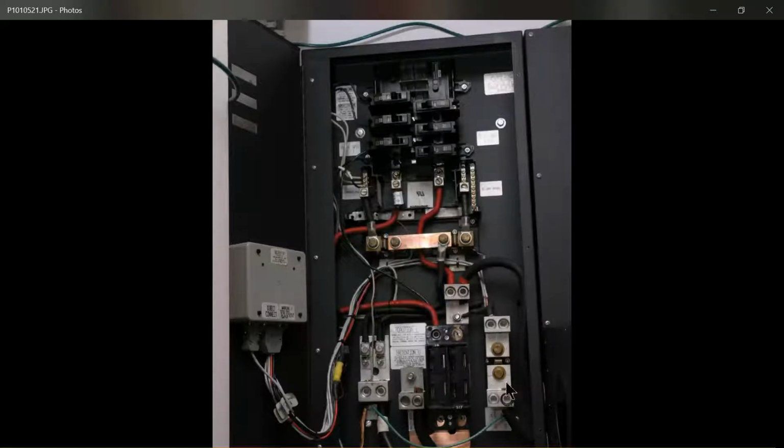Well, essentially what the shunt does is it provides a millivolt voltage point for the meter to reference in order to determine how many amps are flowing in and out of the system. Bidirectional with ones like this where the inverter could be charging or discharging. So that's the negative leg.